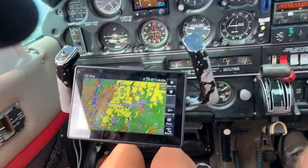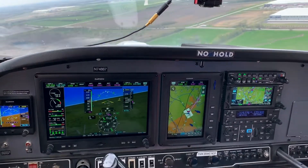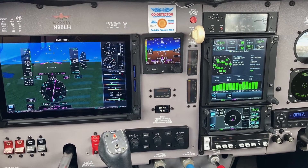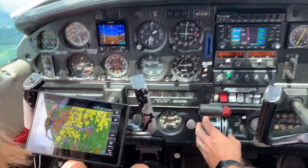It's got a nice hardened design — a nice companion to put in your flight bag or keep in the aircraft as either a moving map reference or a good backup. Another key differentiator between the AERA 760 and other mobile devices in the cockpit is connectivity: you could connect it to the GTN XI series, the GTN 650/750, and even the more legacy GNS WAAS products, and hardwire it for flight plan transfer so all devices remain synced in flight. You can also connect it via Bluetooth to a GTX 345 or GDL 50 series to display traffic and weather.